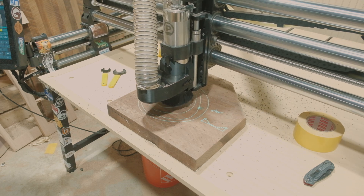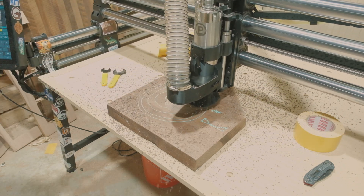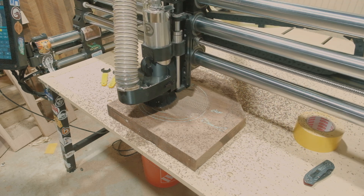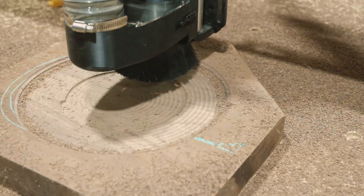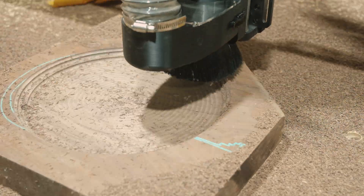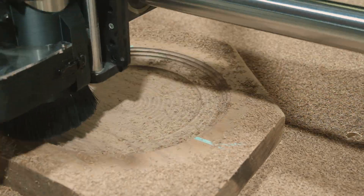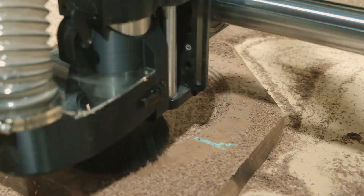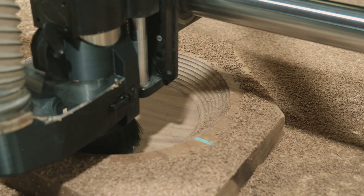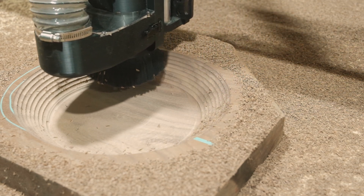Some of y'all might have noticed I got a new dust boot — this is Rowdy Roman's Swinger dust boot, and I'll have that link in the description below. I'm currently testing out a few different dust boots because there's a ton of really cool stuff on the market. I put in the bowl cut bit way beyond the bristles of the dust collection boot, and chips went everywhere — collecting probably about half of the chips. As you can see, this is how we're clearing things out: just a step at a time, doing our full step down, then going in a vector. This is the roughing pass, and then the final two passes are our cleanup paths, leaving a very nice area that'll be really easy to sand smooth.